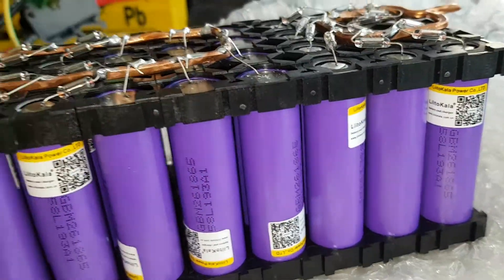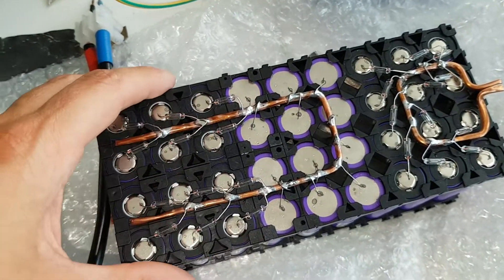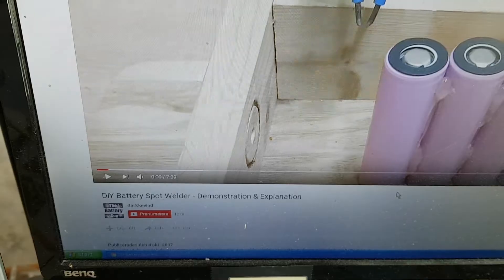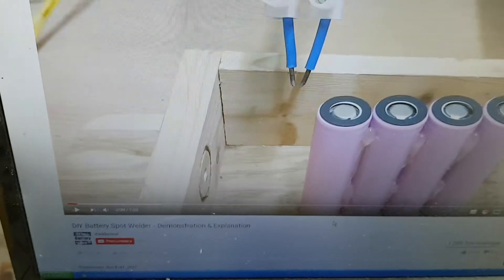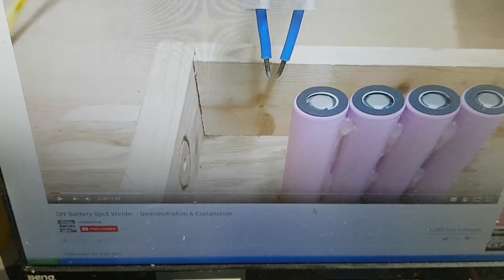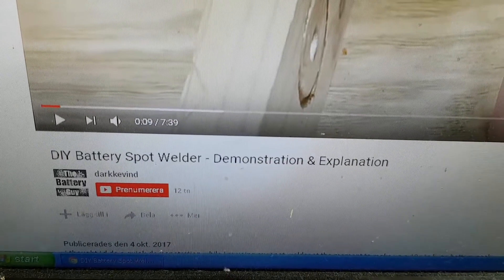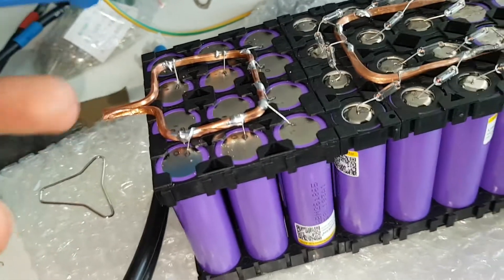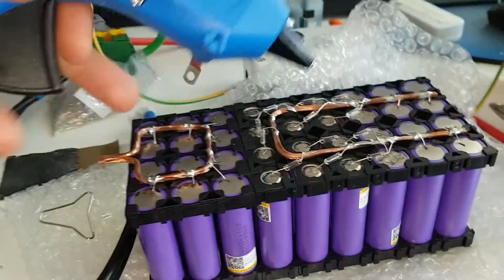I'm using wire from leftovers — they are pretty good conductors — so I only fused the positive. Some of you fuse even the negative, but that's overdoing it in my opinion. I want to give a shout-out to the one who inspired me to do this: it's 'Dorky Wind Do-It-Yourself Battery Spot Welder.' Thank you for the idea — it works great, except it didn't work on the pure nickel strips for me, but you can't have it all. I'll link it in the description below. Now I'm going to put on a cable shoe — 'kabel sko' as we say in Sweden.